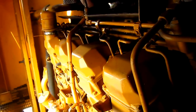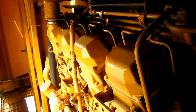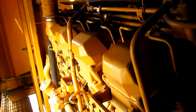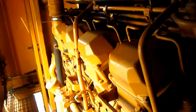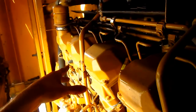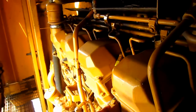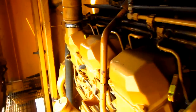Originally, this engine was set to produce 700 horsepower for this machine. However, after further field testing and evaluations by Caterpillar engineers, it was decided the machine was not getting its necessary power. So in 1994, Caterpillar increased the power rating to 755 horsepower, which is what this engine produces. This exact same engine can also be found in the Caterpillar 777C off-road mining truck and the Caterpillar D11N bulldozer — all three machines use the exact same engine.